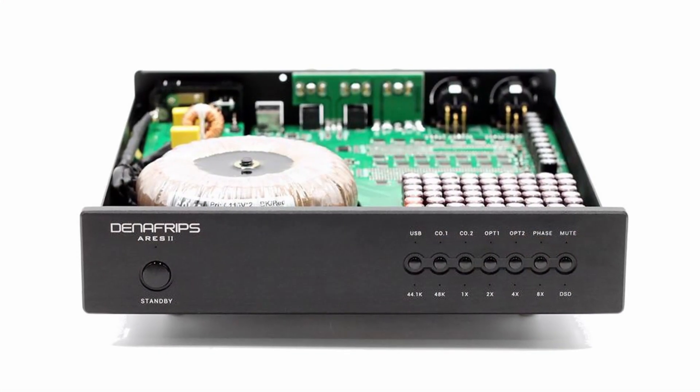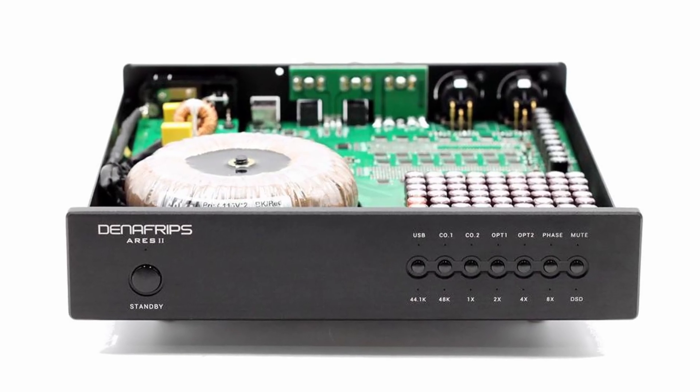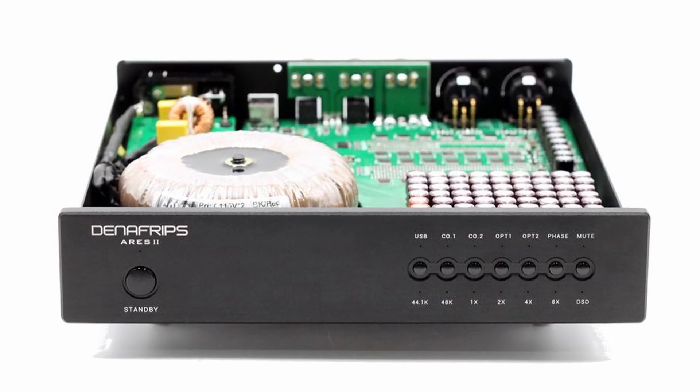The second thing that you want is for the electrical noise to be as low as possible. That could be noise picked up by RF or other EMI, or noise generated within the circuitry itself. The power components within the circuitry of a device can in particular be electrically noisy and, if left unchecked, can upset the sensitive components within a DAC.